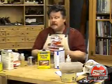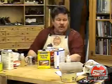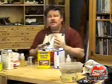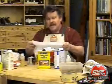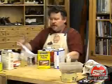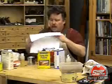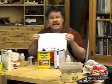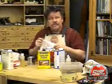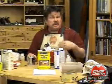So if you're using linseed oil or any of these, once you're done with your rag, don't crumple it up. Do one of two things. Either lay it out flat over the edge of a metal trash can, so the heat is dissipated if there's going to be any heat, or put it in an airtight container like a potato chip can, something that isn't going to let much oxygen in and will extinguish the fire from oxygen starvation as soon as it starts.